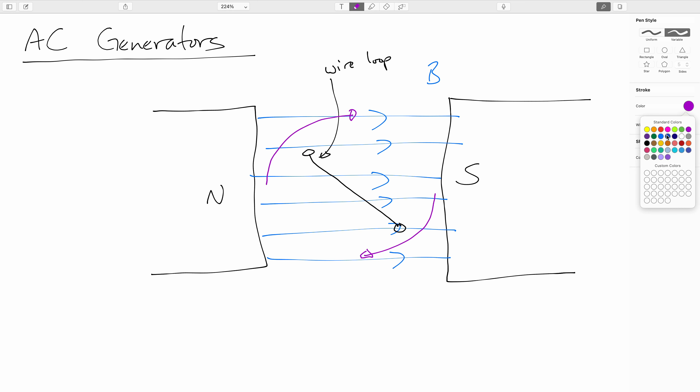If we think about hypothetical positive charge carriers moving in a generally upward-ish direction: point your index finger along this way, turn it so that your field fingers are going to the right. You'll see that your thumb points in, which means that conventional current would flow into the screen over here. And by the same token, it would flow out of the screen over here, as it's going around and around in the coil.